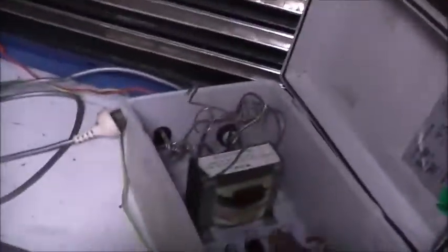I let the magic smoke out, but the primary is still okay. I stopped it just in time as I heard the angry hum — unplugged it. This was very well sealed; a little bit of smoke seeped out. As soon as I opened it up I was like, bloody hell, what happened here? That transformer is rewindable because it's got the secondary on top. I can cut all this out and rewind it, but it's not like a MOT — the laminations are all put in as one assembly. I'll have to chisel and hammer the secondary out and rewind it. It's going to be a difficult task, but I'll have some fun with it.